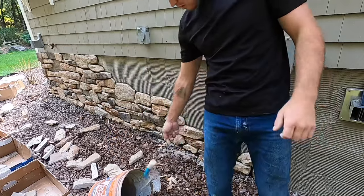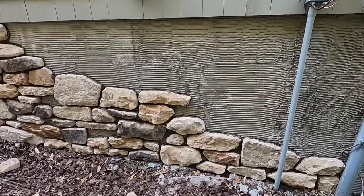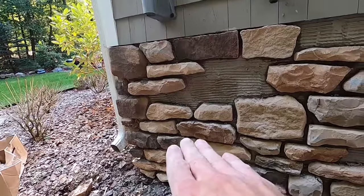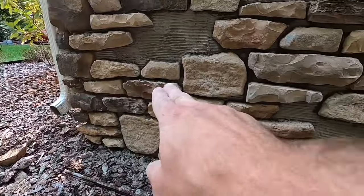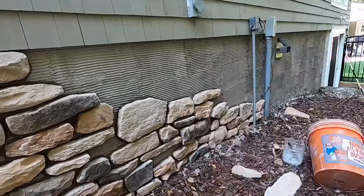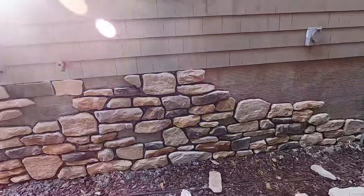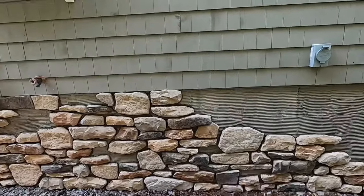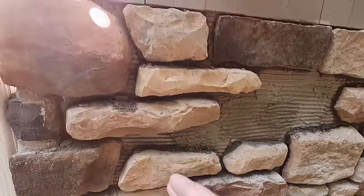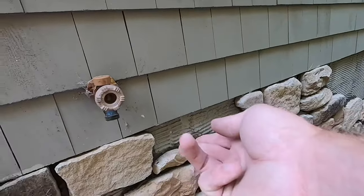Let's talk about how I laid it. I got my level line — that red mark right there. You can see where the line was: I split it after three rocks over here, and over here one, two, three, four — split it. That's how I can keep my stones kind of level. Another thing: I don't want to go more than three when I stack them up. Right here I got one, two, three and then I make sure to cross them — I never want a straight-up joint going more than three. Likewise going the other way, I'll go four sometimes but usually no more than three before putting a split in.